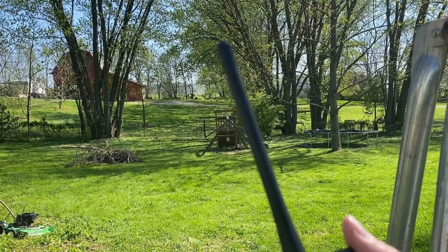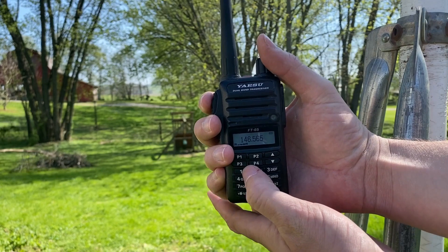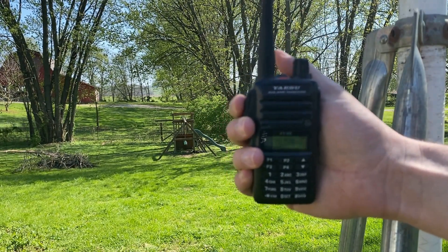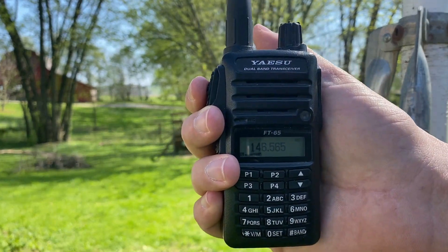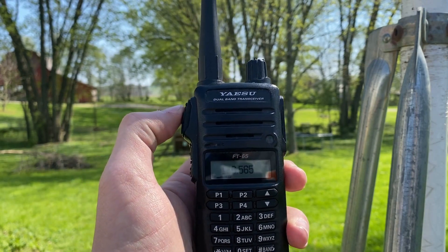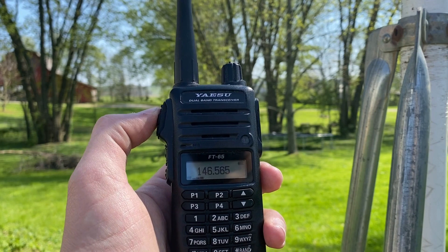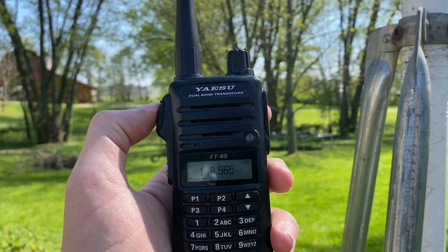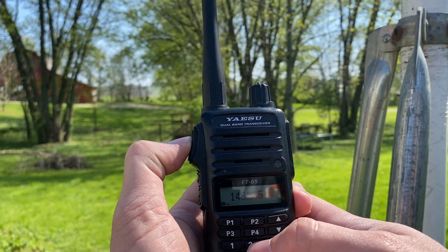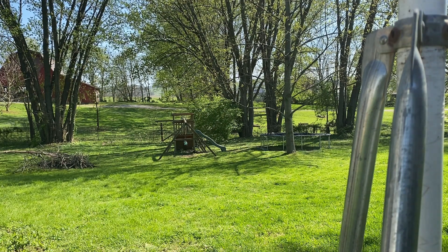So it would take a whole lot of RF with a good antenna to make this work. We'll try this with the rubber duck antenna when it's done. Now we'll try two poor antennas here. It actually can hear that. Of course it didn't take a lot — but you can see the difference. We're a mile apart and that's reasonably doable — you can do that with pretty poor antennas on two meters. Now these PITCON devices are great for experiments like this, you can communicate with yourself so to speak. If you want to do some VHF experimenting — experimenting in part is allowed under Part 97 and test transmissions, so two meters is okay to experiment on as long as you ID. Our device on the other end is IDing, and I will ID here as I stop the machine. Hit two. KB9SNL. And now I guess we'll go pick up our transmitter.